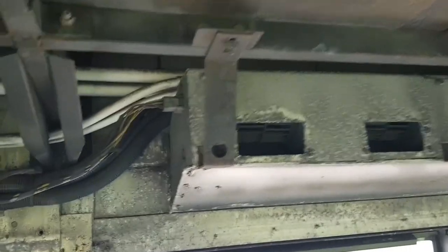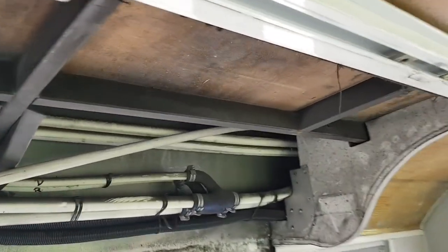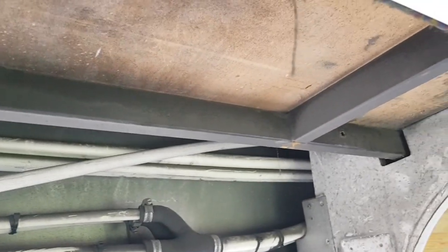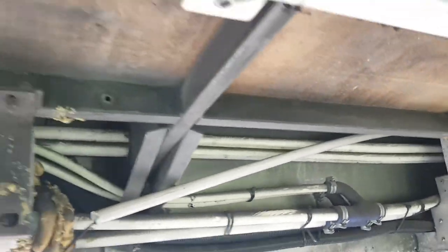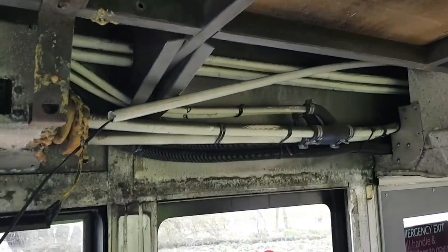Unfortunately there is lots and lots of stuff like this in the cavities of the wall — old electrics for all the old lights and heaters that are in place. But we're going to be disusing most of these, so we're just going to disconnect the points like that, tuck all the wires away, and just keep the main trunk lines — those two there are for the starter motor, on/off, and basically engine electrics. Lights and engine electrics are the only electrics we'll be keeping. Everything else we'll be taking out or just tucking away in the wall and forgetting about.